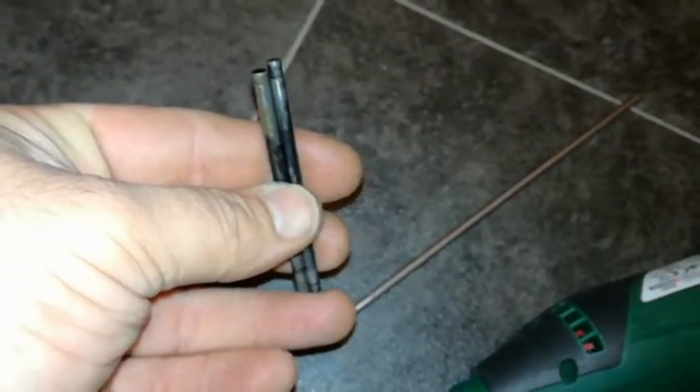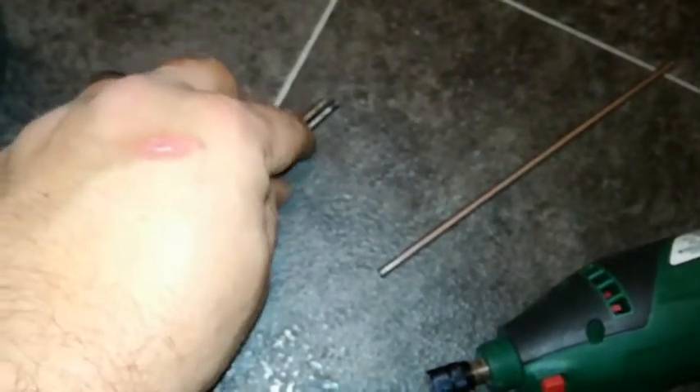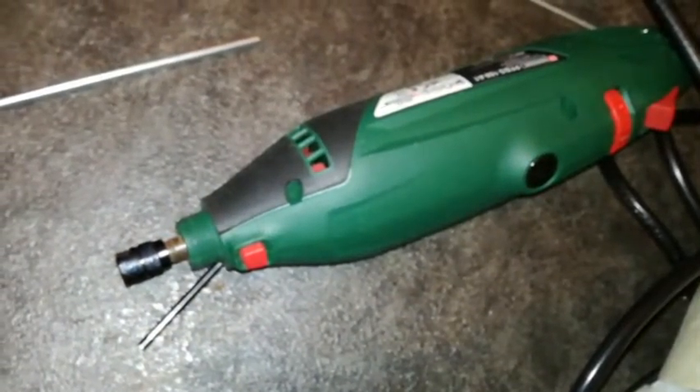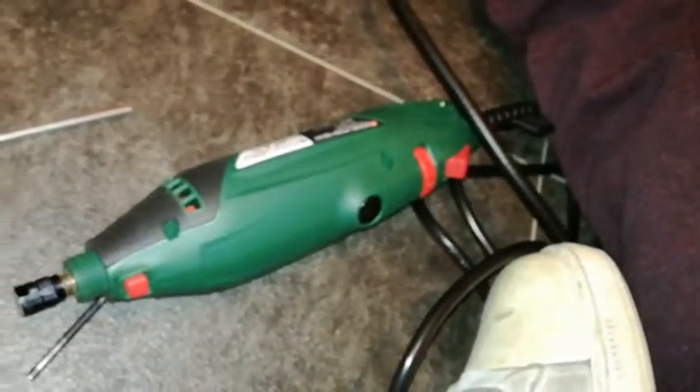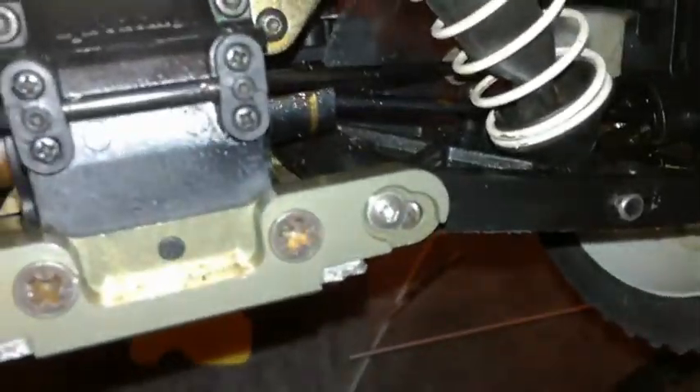I wanted a matching pair at the back, so I cut two new ones. This one wouldn't fit properly — I had to put a spacer in to hold the thinner, longer one in. So I got them and cut them — I cut this bar with my trusty cheap Lidl rotary tool. I used a very thin grinding disc; I actually used two grinding discs because that's how hard the metal is. Ground them down, and in they went — solid as a rock, perfect width, nice snug fit.